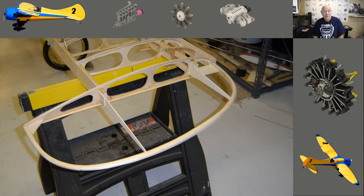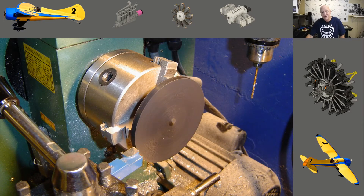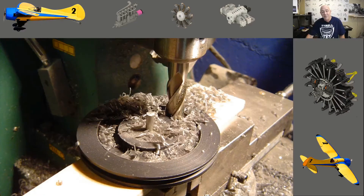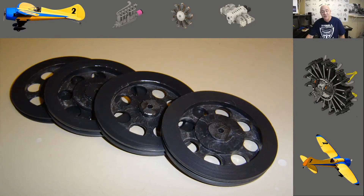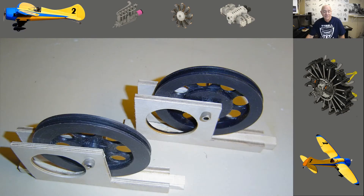The wing tips were stripped down to about 3/32nds from 2x4 material, then soaked in Windex and water overnight so I could bend them into shape. I put Titebond wood glue between each layer of laminate when I bent it — I wish I had a picture of the jig. I was also going to use all aircraft cable and pulleys to control the flying surfaces like a real airplane. So I got some nylon 6 round stock and basically machined nice little pulleys, milling them out to make them light.